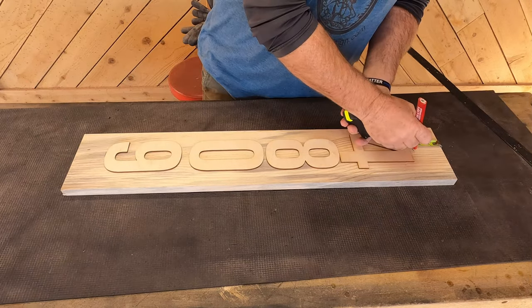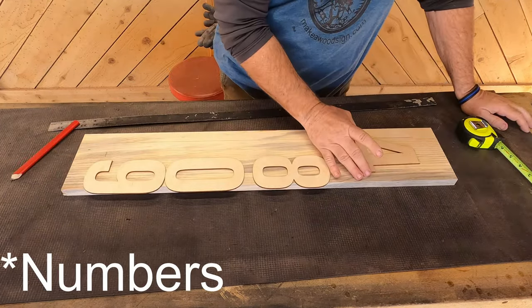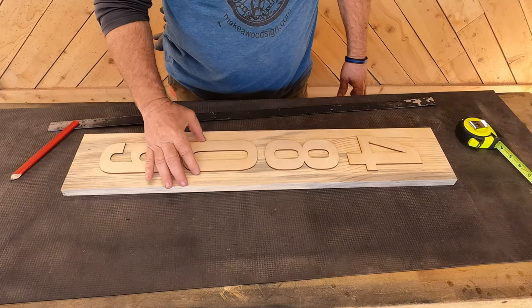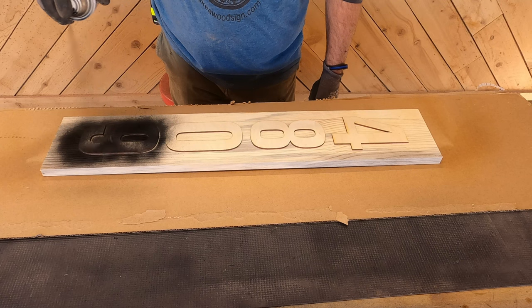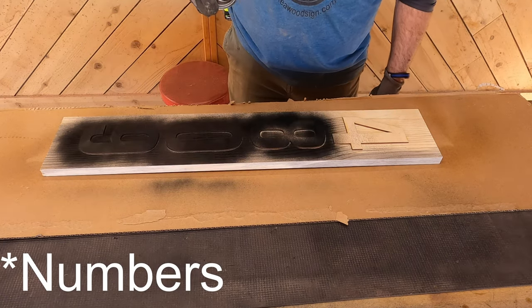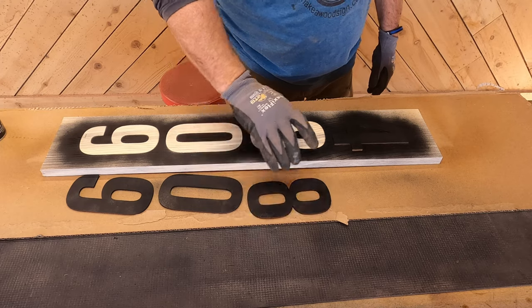Dad's making marks on top and bottom to make sure he gets even spacing, and then he's making marks on the left and right of the letters. These are really important — you want to make sure you have even spacing, because if that line is off, your vertical sign is going to go at an angle, and that just looks funky. Once he has his letters all laid out, he sprays it with primer, and makes sure not to overspray, because this is pine and it will bleed.